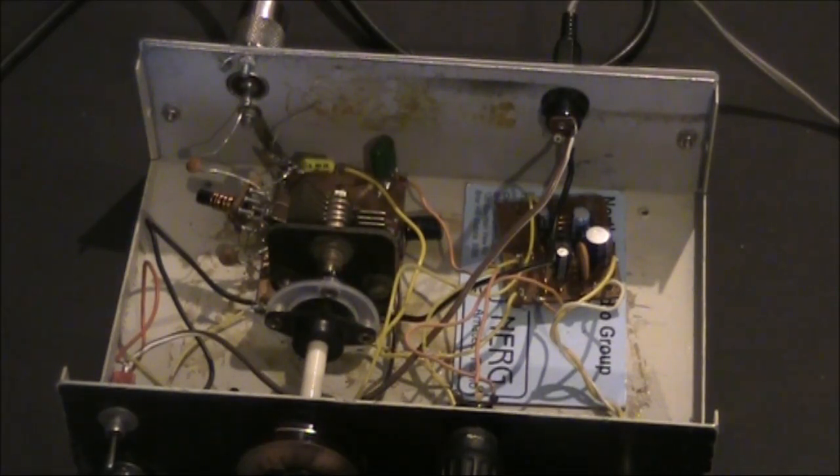1, 2, 3, 4, 5 — counting audio being received from the walkie talkie demonstration. Varying the voltage applied to the BC548 collector, you can hear the amount of hiss changes. It also detunes it a little bit.